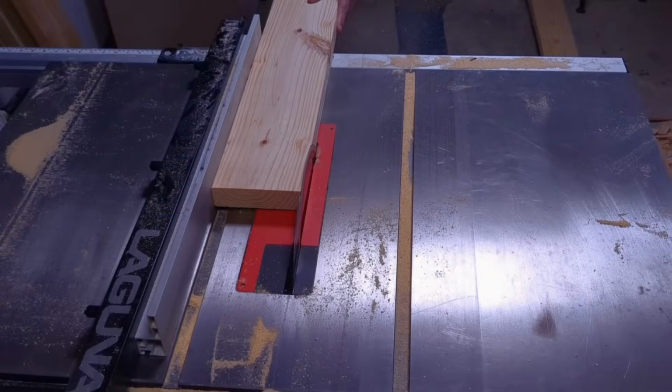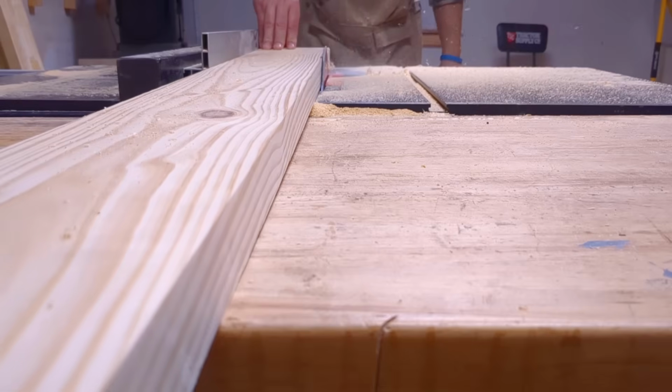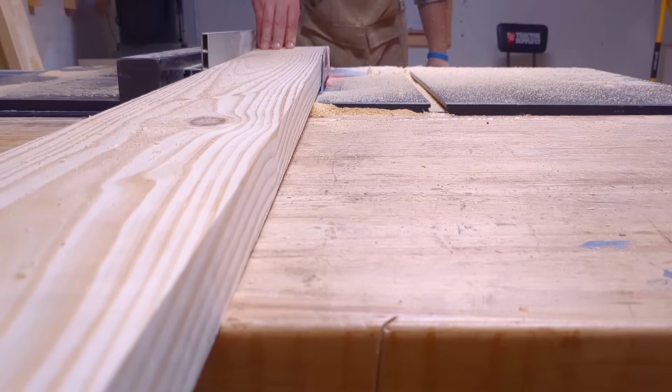The reference for the cut list will be in the description or in the link to my website, so I'm not going to spend a lot of time talking about it in the video. The first thing you're going to do is square up one end. You want to get the roundovers off of one edge of the board. You don't want roundovers. We want to make everything as square as possible. So you're going to take off the roundovers by setting your table saw fence to rip off just the 1/8 inch, a saw blade thick, to get the roundovers off of one side. Then that's going to be your reference to run through the table saw.